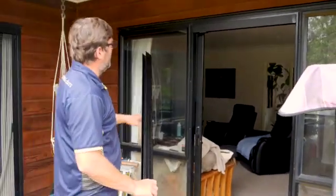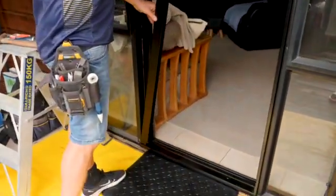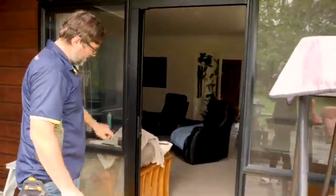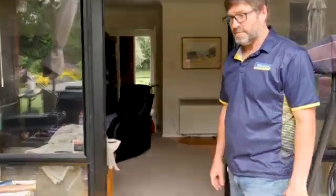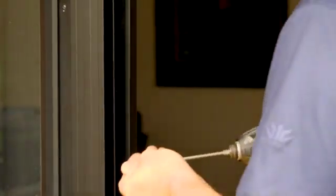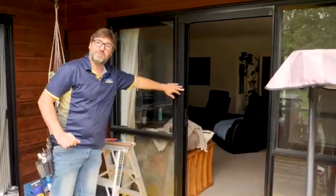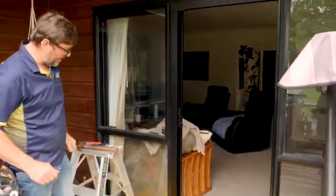Our next section is the cartridge end. So the cartridge end slides in from, I put it in from the bottom on an angle, put it along the top. And again, we just have to keep it parallel as we go down the jamb side here. And again, all we need to do is put a couple of Tech screws in that to hold that in place. In this case, the cartridge housing does have holes pre-drilled, so you can line those holes up with your Tech screws. So I've got a nice parallel finish running down there.